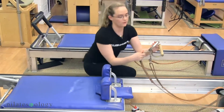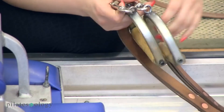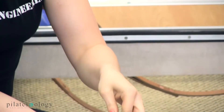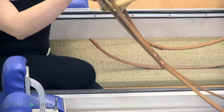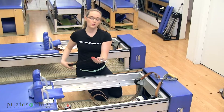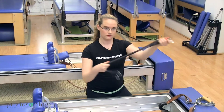I'm going to lift the handles up and take a look at them. You want to make sure that the handle — either the leather or the metal handles — is intact and that the bolts are tight, and that the snap hooks that attach the leather to the handle are in good condition. The snap works and the swivel part is not worn too much. Once we've done that, we'll take the handles all the way to the end. Now we'll take a look at our long spine straps to make sure that they're not frayed and that the snap hooks attached to them are also in good working condition. Then we'll just put these back.